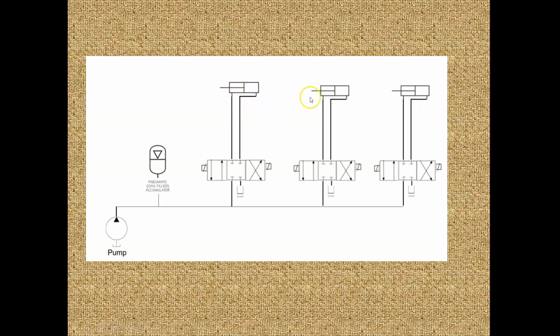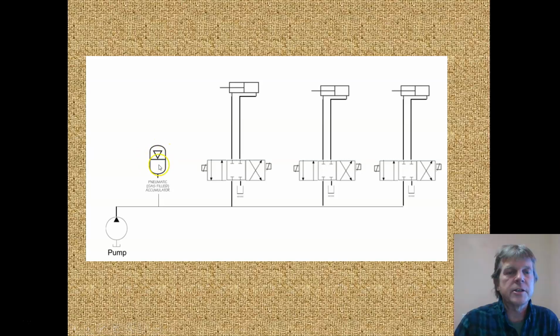We've just started the engines. The airplane's sitting, idling, and the passengers are in the airplane. Pilots are in the airplane, but we're just sitting there. So this pump is capable of putting out 3,000 PSI, and it does. And what happens is that we're not using any fluid. So this nitrogen charge, which we charged at 1,200 PSI, well, the pump is putting out 3,000. So if I have 3,000, I have a rubber bladder between the hydraulic and up here is the nitrogen. This guy is 1,200. This guy's 3,000.